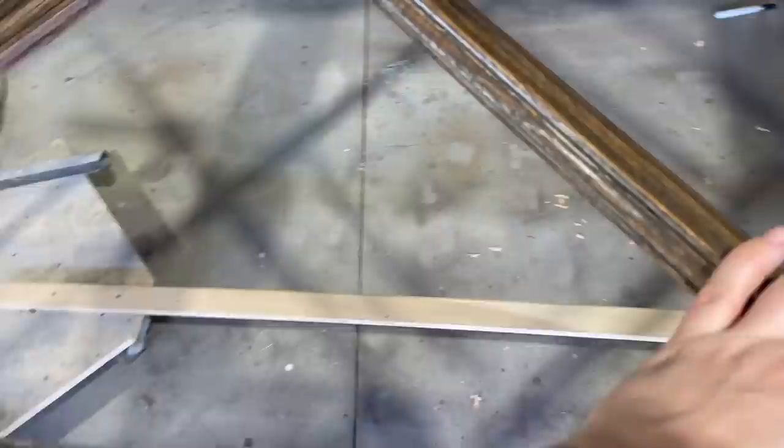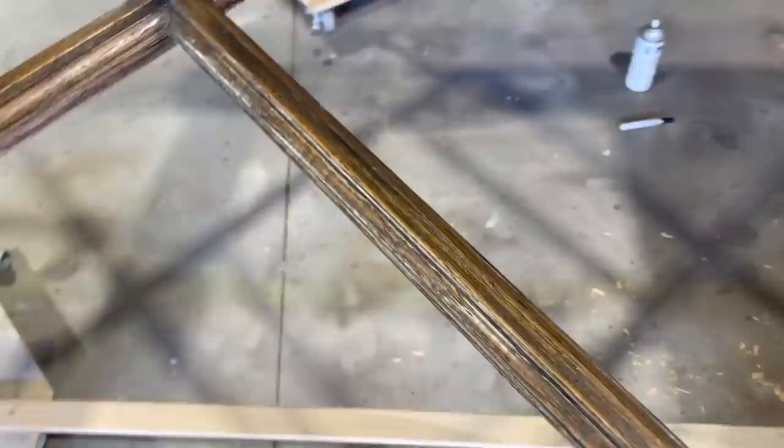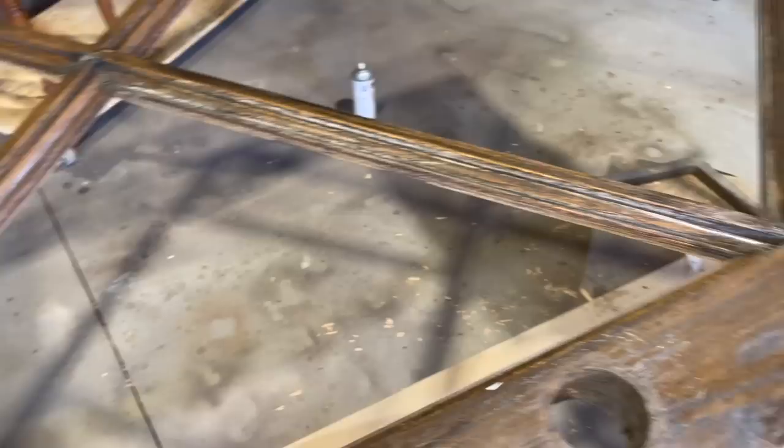So this is really what the exterior should be, but the house, I did stop by this week to see if there's any indication that it was put on there the other way, and there's not. So just from the day it was built wrong. So we're just gonna have to stick with this and try to seal up the other sides using some caulking and all other methods that aren't as great as this, but gotta do the best we can with what we got here. So I'm just gonna get on to stripping whatever I can get to and get this side sanded and prepped and then figure out some color.